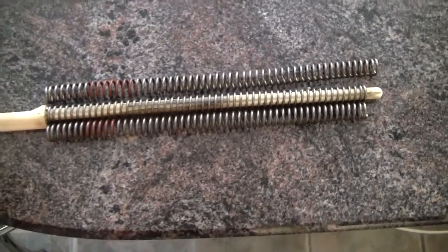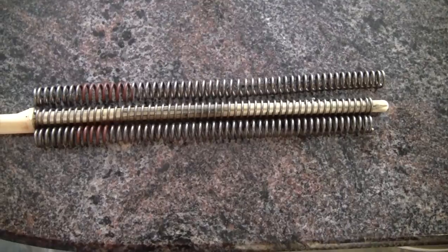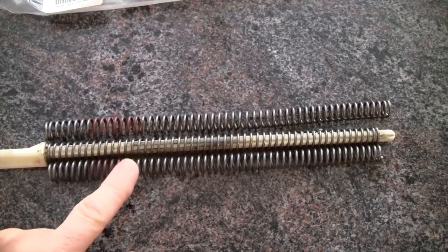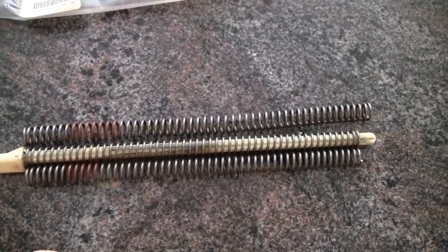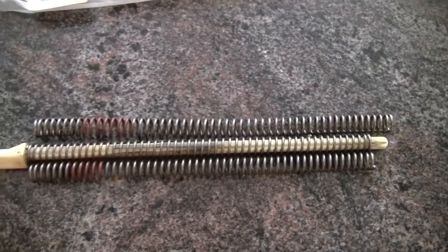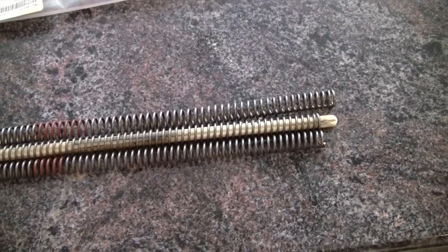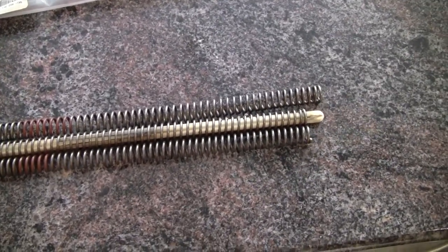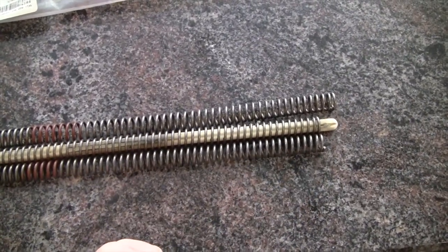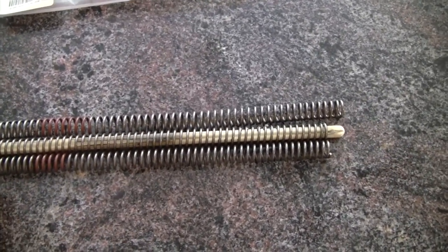This plastic piece is the rod that I was speaking of. And you can see that I've got actually three springs here — these are spares because I have to replace these more often than not. This looks like an old one; you can see what its free length is. This may be a new one — I bought a spare. You can see this one's a little bit longer, so when you put that rod in there, it's always compressed a little bit, which holds up that other piece. When this thing gets used too much, the springs start to shrink in free length as they get worked or fatigued, so you have to put a new one in, otherwise this whole thing falls apart.